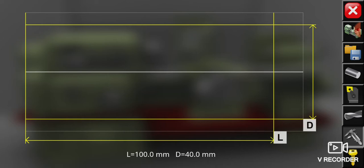Now we have confirmed our material measurement: 100 millimeters in length and 40 millimeters in diameter. As per our drawing plan, for this exercise we want to reduce the length to 85 millimeters. So we must perform the facing operation to cut off 15 millimeters of workpiece thickness. Now we begin our operation.